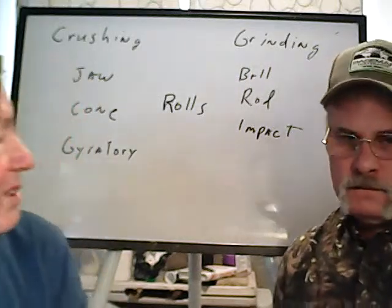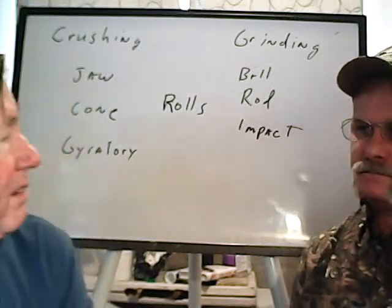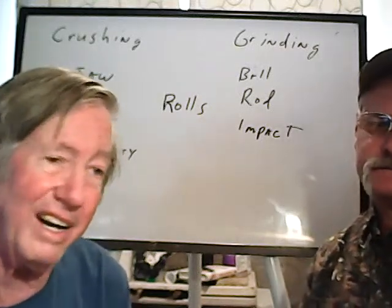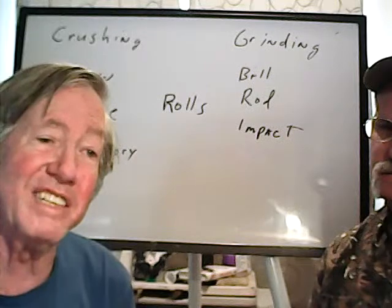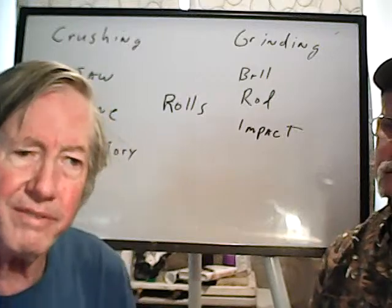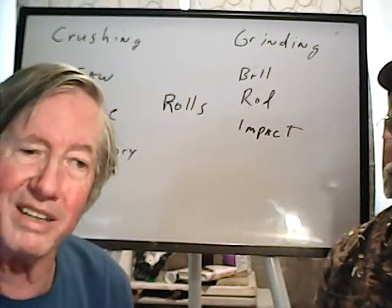The flux is expensive according to him. I wouldn't doubt that. For what we're doing in terms of smelting resin, that may be a perfectly acceptable type of flux, if that effectively digests it at a reasonable amount of resin. Right now, we believe we're at a high oversupply of flux to resin. We're pretty confident in that, but too much will not hurt. So the idea is, does it work? Then we're going to see, does it work on the oven dried resin? And then we'll kind of tune things down from there. We want to minimize the total amount of flux, the total amount of litharge.